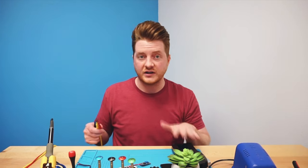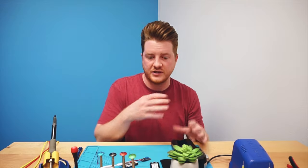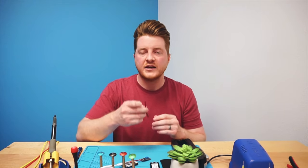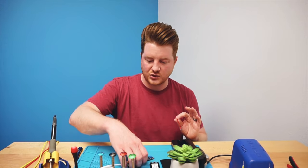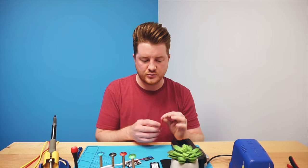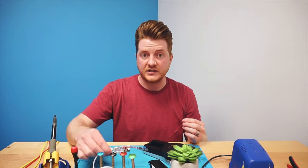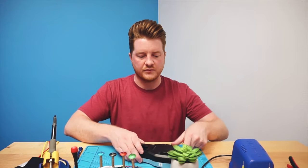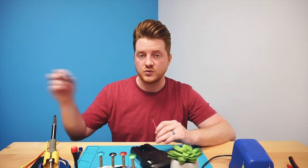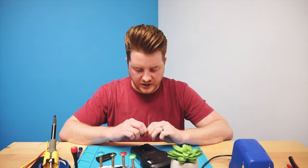Now we connect the booster output directly to the device's battery terminals. If you have a 3D printer you could create a battery enclosure, but in our case we're just going to connect directly with wire. I pre-measured the wire to about two and a half inches — enough length to pull the whole electronics assembly out of the battery compartment while still leaving it connected and easily chargeable. We solder this directly into the battery terminals, keeping it plugged in since the battery is only at 3.3 volts. Looking at the original battery, the negative is on the left and positive is on the right, so we wire it the same way.